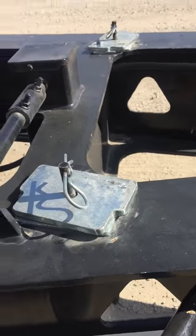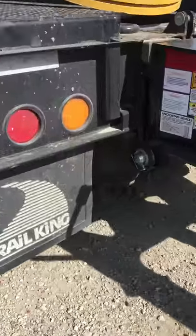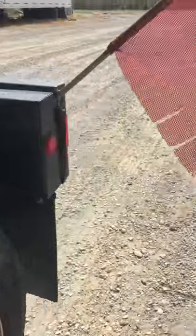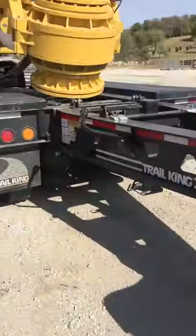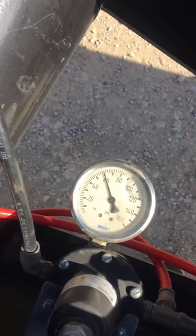With IMTs I've moved them enough that I know I want the thick one and then the thinnest shim in the pack. Basically the end result is: you can see this is the third axle of the trailer — how much bell you have showing — and here on the flip axle you have pretty much the same amount of bell showing. That's the goal; that way everything rides good.